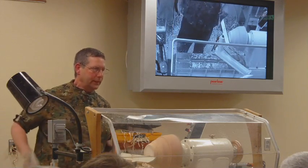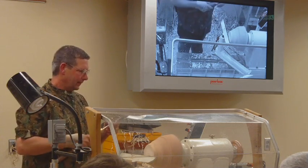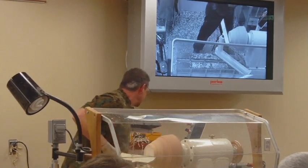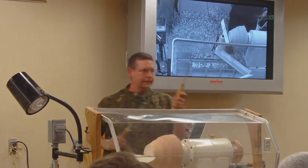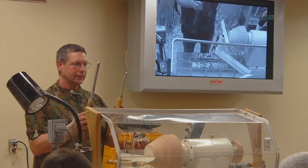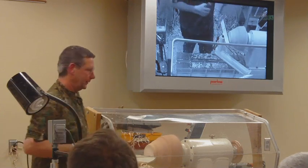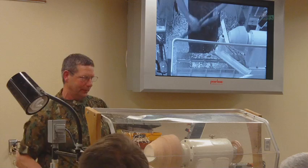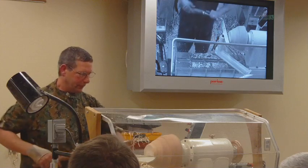When I started, they said put the tool rest a little bit below center, right? Is that what everybody says? Well, to me, if you've got a tool that's this big, and a tool that's this big, there's going to be a different height on your tool rest. I was measuring it, and I'm like, this thing ain't working, I've got to move my tool around. So we've got to get comfortable with it.